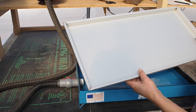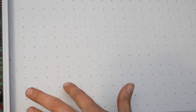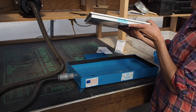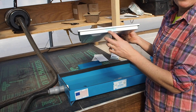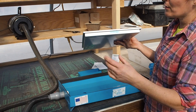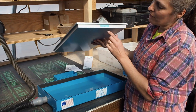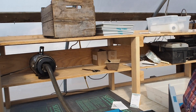Seed plates are ordered by the number of cells, number of holes, and the size of the hole, depending on the type of seed. Obviously some seeds are bigger than others, and the manufacturer of the plug tray also matters because their spacing is a little different — sometimes there may be a rib in between. The first number on the edge is basically the size of the hole. Seed Easy has a chart on their website where you look up your seed type and it tells you which number to use. For broccoli today, that's number 16, 512 cells, and TO — meaning TO Plastics. They're not cheap, so you want to standardize as much as possible.